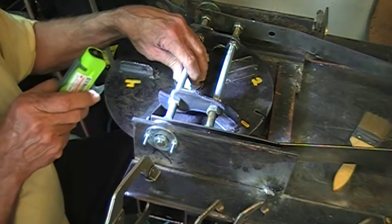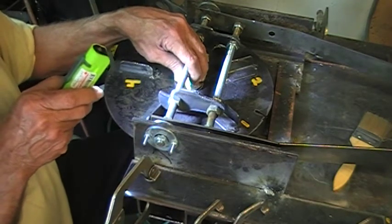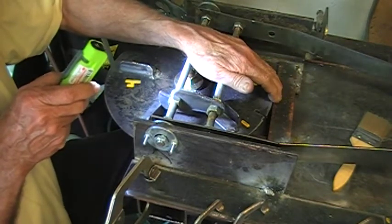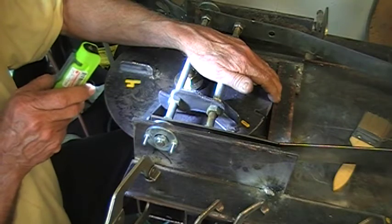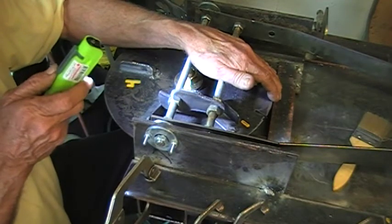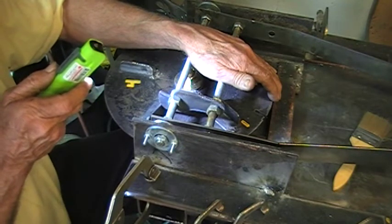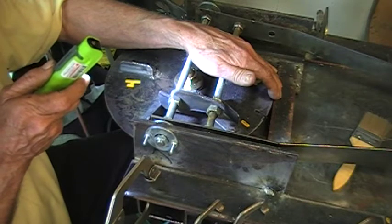The reason for this machine, like I said in an earlier video, is so that it's smaller — so we can adapt it and tweak everything out so that when we build a bigger machine, the bigger one outside right now weighs 512 pounds, the pendulum itself. We intend to bump that to somewhere between 1,000 and 1,200 pounds and put an escapement on it. The power transfer bar at the top is designed wrong, so we're going to totally redesign it. If anybody's interested, when I build the transverse multi-compound lever, I'll make some short videos showing you how we're doing it.